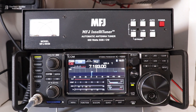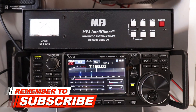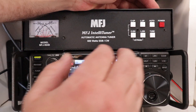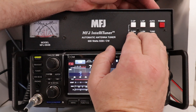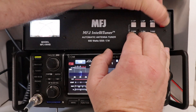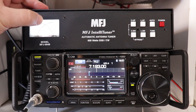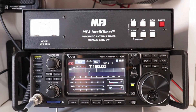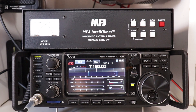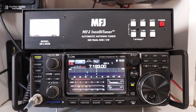If you've been using it for a long time, switched radios, or added an amplifier, you'll want to start with a clean slate. Power down — here's how to reset everything. Push and hold C down, L down, and tune, then push power. The needles will come to halfway on the scale. Then push C up; the needles will go straight up and down, and when done they'll drop back to the bottom. After that you can start using it again — turn on your tuner and you're ready to go.